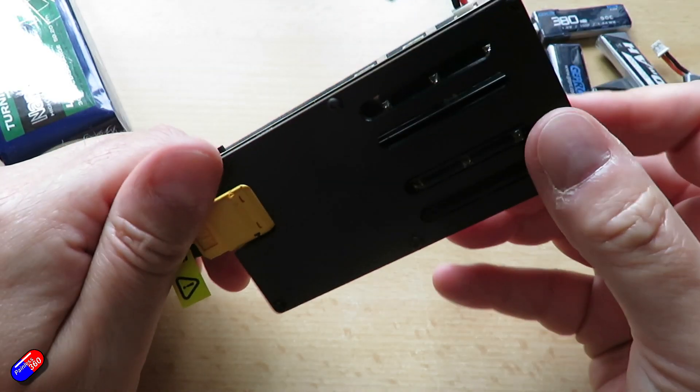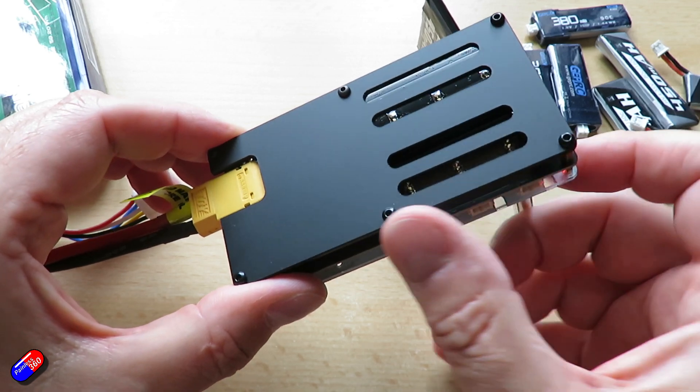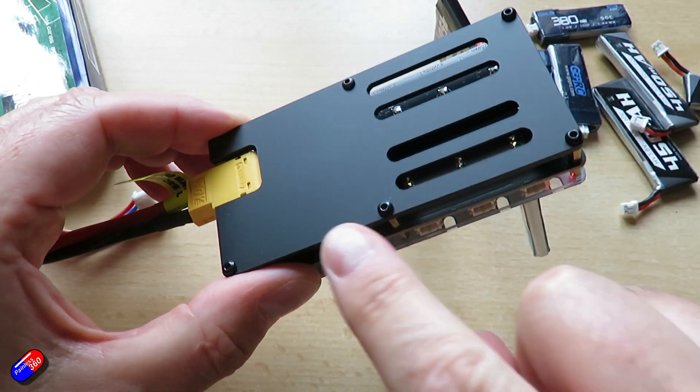A couple of things to be aware of: you can only plug one battery into each port, so you can't plug 12 batteries in — I know some of you were probably thinking exactly that. There's no chance to use it with a regular 5-volt supply; you need a PD or QC USB style charger, a LiPo battery, or an external power supply. Also, small thing, but there aren't any foam feet on the bottom and none in the box, so you don't want to put this on a French-polished table — sticking some foam on the bottom might be a nice idea.